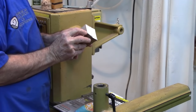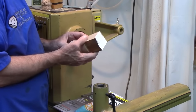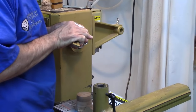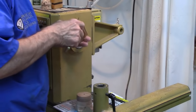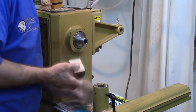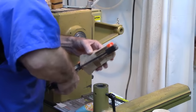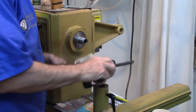This is a very thick tape with some cloth in it to hold it. It's about eight or nine years old, but if you clamp it real good it has amazing strength - it's a lot different than carpet tape. I'm using two pieces so I can get full strength; one piece might hold it but let's not take any chances. We're just going to eyeball this on center. The real trick to getting the strength is clamping it and letting it stay for about ten minutes under clamping pressure. People who've had failures frequently just slapped it on and started working. So we're going to come back in ten minutes.